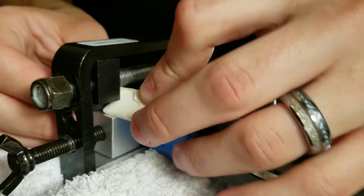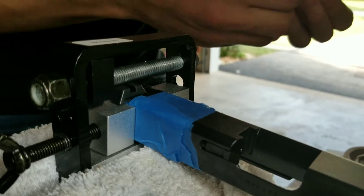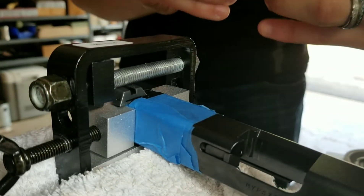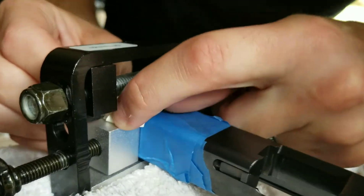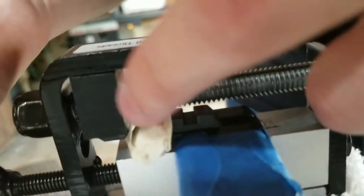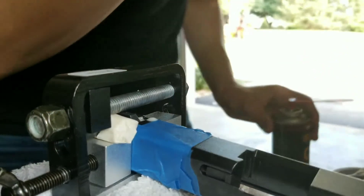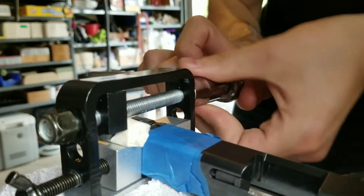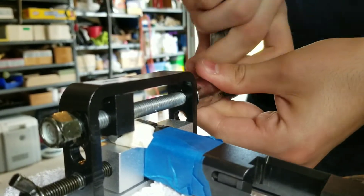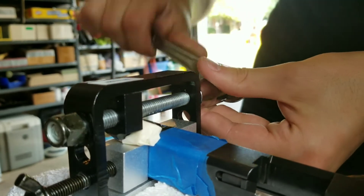Getting my tape ball formed up. You can't go too big because it won't fit in very well, but generally speaking, the bigger the better. I'm going to slide that in there and make sure there's a good amount of cushion for that sight. Then I'm going to give some oil into the dovetail. Make sure my socket's going to be going righty-tighty. You'll start to feel the tension build as you get into that tape, and then your sight will slowly start to push.